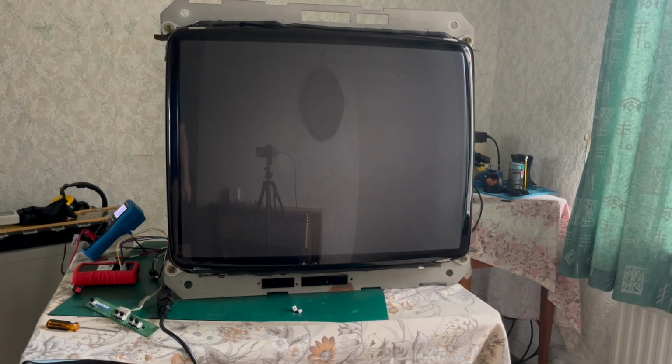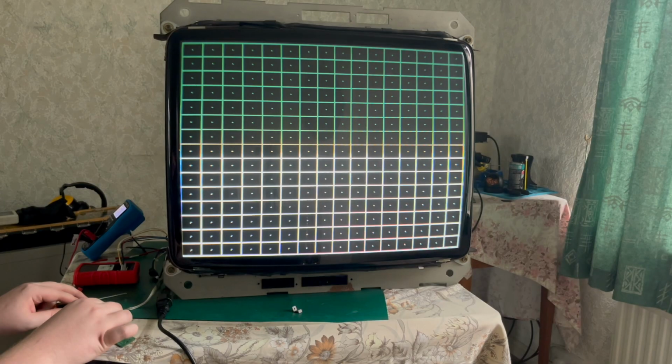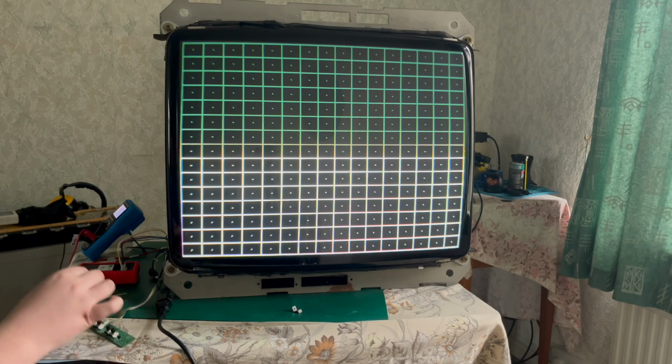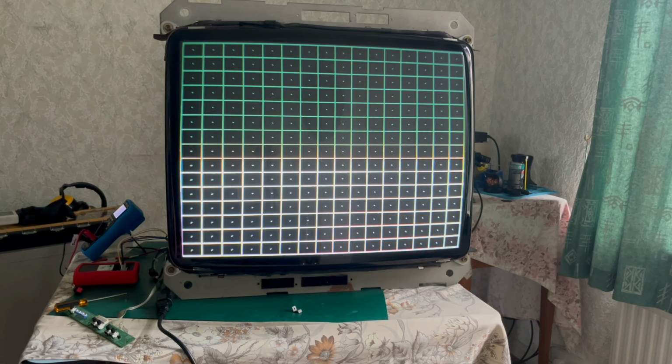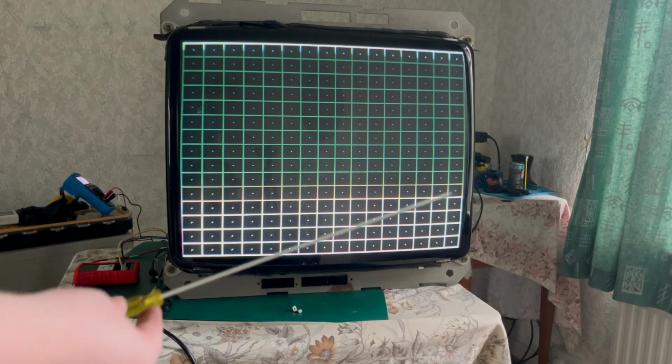Okay, so we're apparently looking for 76 volts on the B+. And we're getting 75.1, so a little bit low. Is that enough to make that annoying noise? I don't know. I'm trying to remember what these do now. Okay, well, all of the pots work nicely now. That looks pretty damn good. Like I say, the B+ is a tiny bit low. And I need a flathead to adjust that. Got the world's most elaborate screwdriver here for the job.